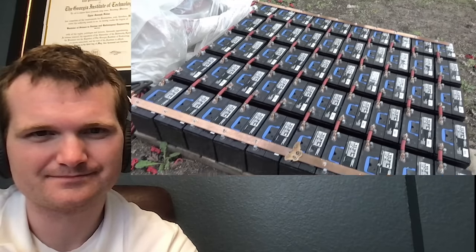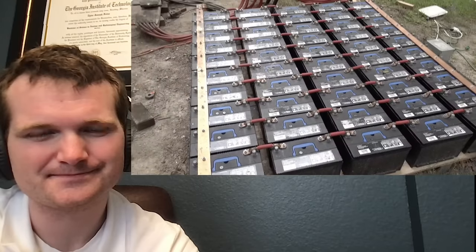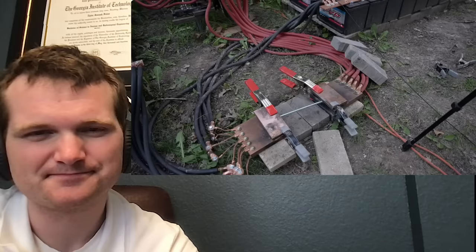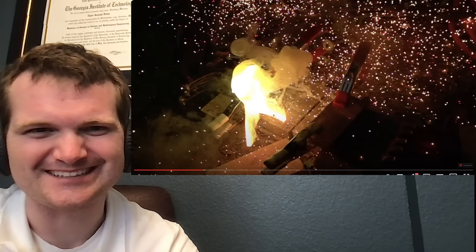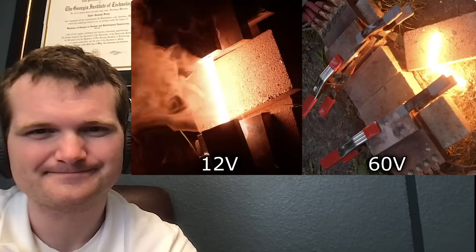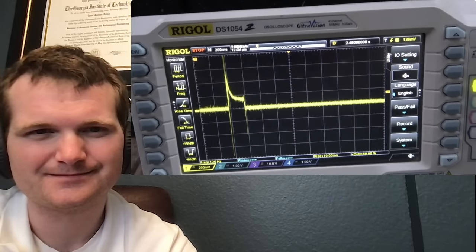I think using higher voltage will overcome these problems, so I rewired the bank for a series-parallel arrangement — chains of five batteries in series, then all wired in parallel. This makes the fully charged bank sit at a little over 60 volts. Let's start the 60-volt experiments with another three-eighths-inch steel rod. The rod heated so quickly that its zinc coating boiled off faster than it could burn, and when the rod finally exploded it left a cloud of greenish plasma as the zinc vapor reacted with oxygen in the air. Sure enough, I clocked a peak of 30,000 amps — which happens to be the current of the average lightning strike.